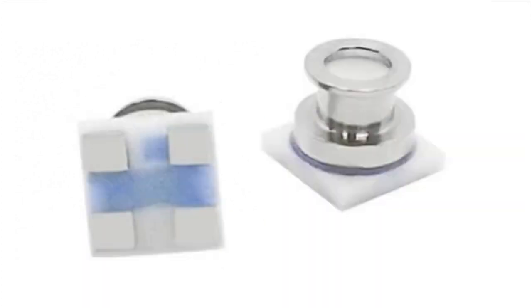This is what it looks like. This is a pressure sensor that is designed to be used in chlorine environments. So it's not just waterproof or water resistant — it's also chlorine resistant, which is important because chlorine is what's in not only pools, but in the ocean and lakes and rivers sometimes. And it is what causes corrosion of sensors — it can really damage them.